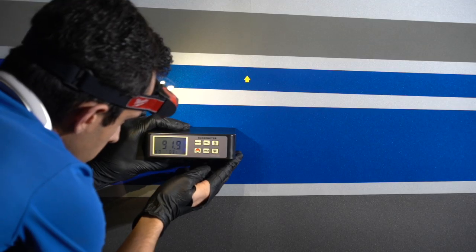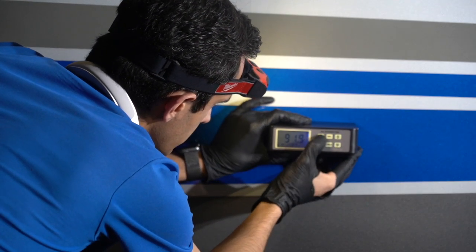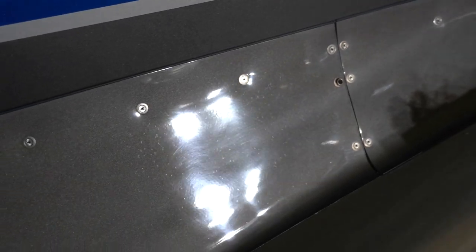And for the coating to properly stick, we still have to do a paint correction. That's going to refine that surface, make sure it's clean, uniform, ready to accept that coating. Even with a new airplane, we can still show an improvement in gloss. It's subtle, but it's measurable. And there's areas on the plane where there's a little bit of swirls and scratches just throughout the delivery process. They fly these planes across the Atlantic to the US, so they get dirty, they get exposed to stuff. Paint correction is going to make it look just that much better, and then we coat it so it stays looking that way.